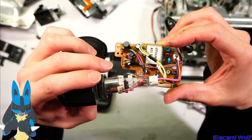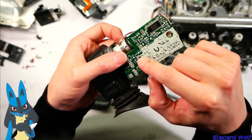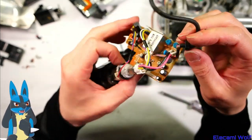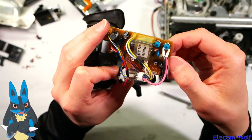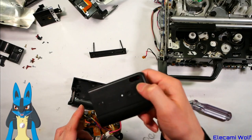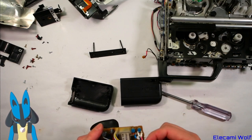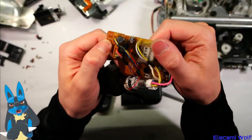That does most of the heavy lifting. It's got surface mount — that probably drives the flyback and the other deflection. Then there's some high voltage stuff going on there, and they've wrapped the input cable around the high voltage wires — these two various grids and things. There's a deep recess there — focus, brightness. That goes to those — they've labelled it: Grid 3, Grid 2. Looks like it could have had a tally light on it as well.